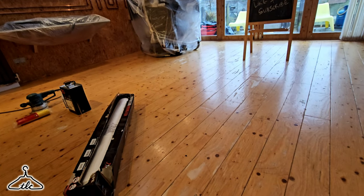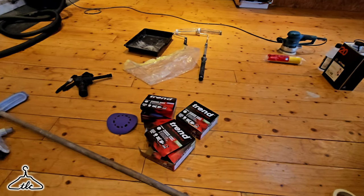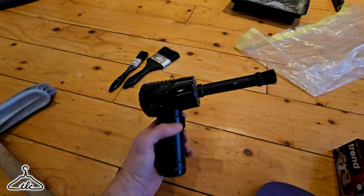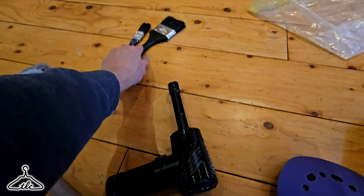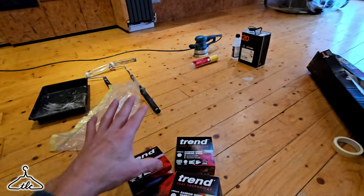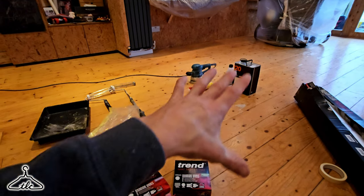All of this floor was really light when I first laid it and it's gone dark — the sun changes it, makes it go more yellow. We've got a couple of brushes, a little air duster. Some disposable brushes to go around the outsides. Once I've sanded back and it's ready to lacquer, I'm going to do the perimeter first and then work my way in with the roller.